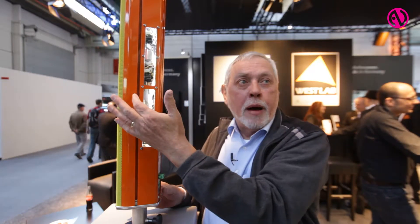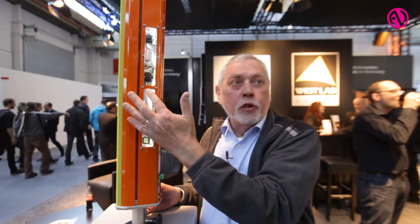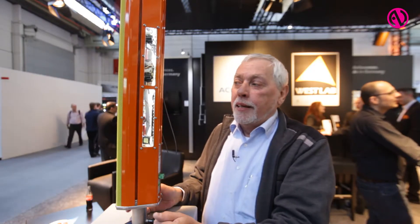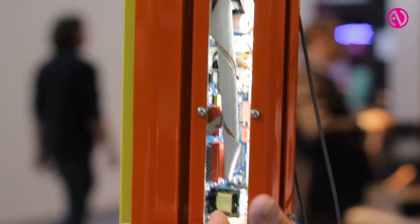We can add to the PAN Powerline a typical PAN Beam digital steerable loudspeaker called the PB08. The PB08 is based on eight loudspeakers powered by the smallest power amplifiers ever designed — two times fifty watts per PCB, with one PCB driving two three-and-a-half inch loudspeakers. Four of those blocks give you eight times fifty watts. In the lower part is the DSP area where all setup data is stored — column steering direction, height, depth, EQs — everything is in here.